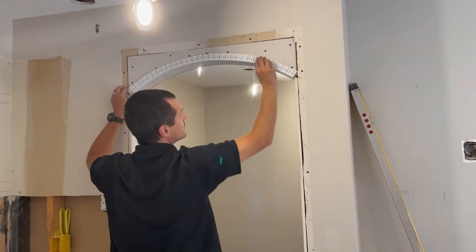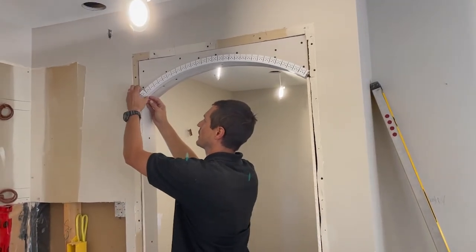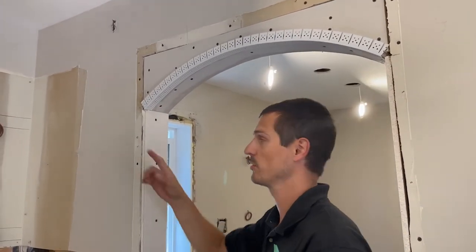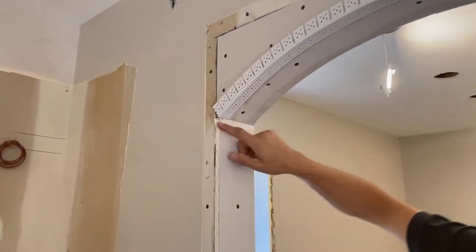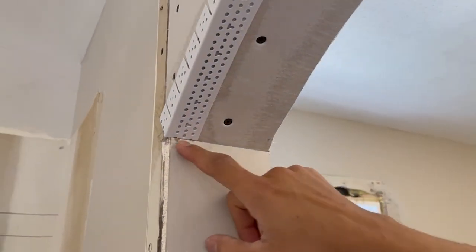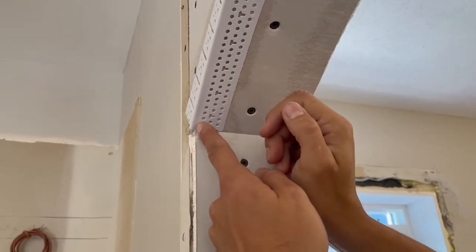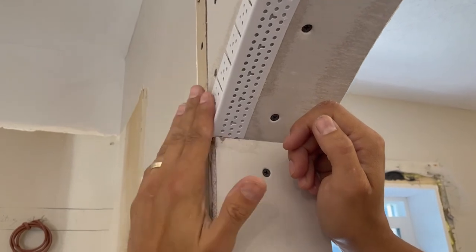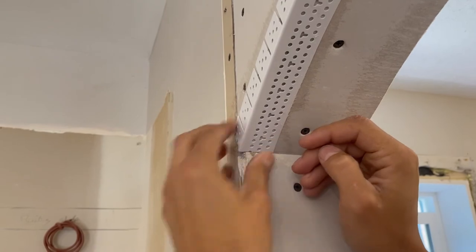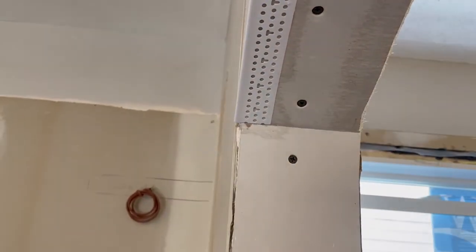Take this off. There we go. That one on. And I have to slide this side a little bit. There we go. Originally this side, if you come over and look right here, from this corner, this edge was too low. The corner was like right here before, and then you would have essentially a big hump here, which is not great. So I just slid him out. This surface has to be beyond this surface, just a hair. So that's the first one.